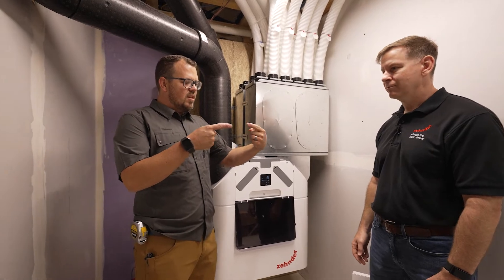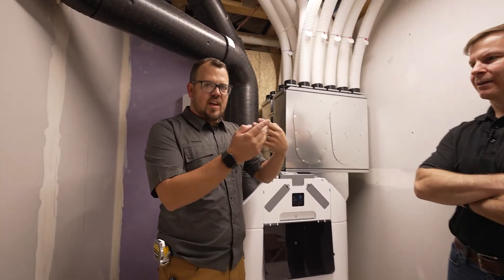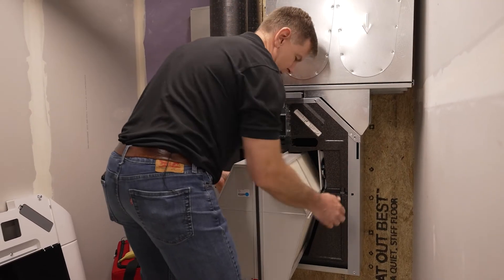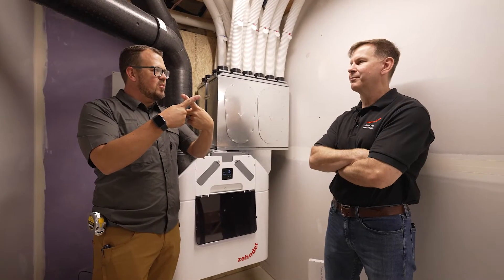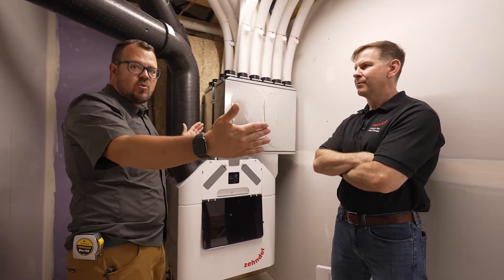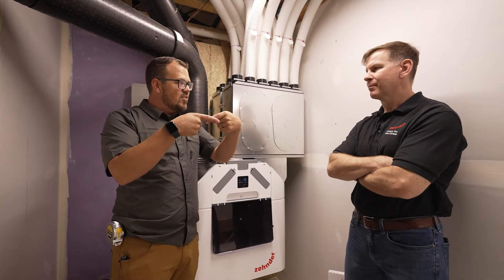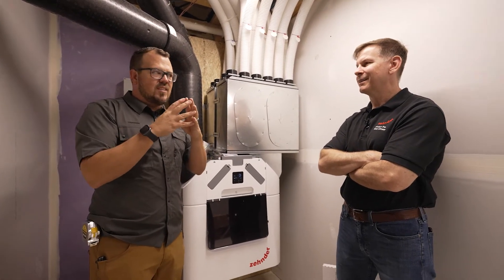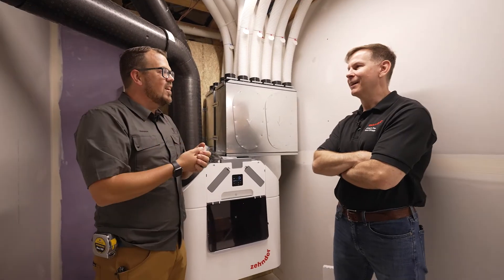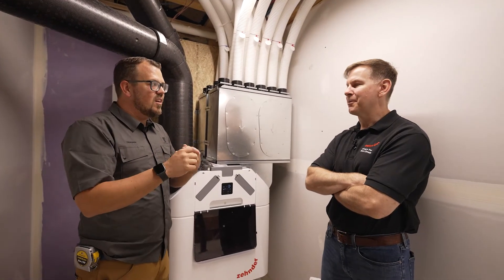Effectively there are tunnels that touch each other without mixing — the more tunnels you stack together, the deeper that core gets, the more surface area each slot has to share with its neighbor. If you just had two pipes running next to each other touching in one spot it wouldn't be effective, but spread that air over 20 to 24 inches of depth and you have that many more sections of membrane that can transfer. The air mixes without touching — it's the most ridiculous way to describe it, but it's correct. They're sharing humidity and temperature across that membrane.